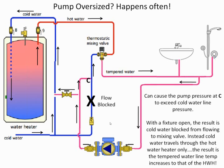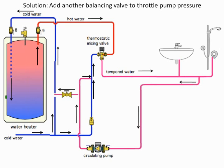All right. So, you know, you've got to be careful. Again, we stopped and we have the check valves. But let me show you some other things, let's take a look at another balancing factor in our throttling of our pressure. So many times, as I said earlier, we don't really want a circulating pump to increase the pressure, but most of the times they do to a certain degree. I went and did a program one time to a bunch of engineers, and I said, you want zero head pressure for your recirculating pump. And a person raised their hand and said, there's no such pump. And I said, I know, but I'm giving you an example so that you don't oversize your pump. So really, we don't want any head pressures.